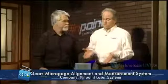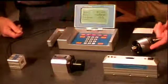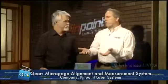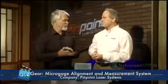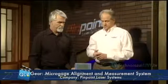Exactly. Okay. I mean, a typical example is in paper mills and applications like that. They'll set the laser up in the aisleway and they'll shoot the beam 80 or 100 feet down the aisle, and then they'll place this down at the distance to redirect the beam in to check rollers to see if those rollers are parallel. And that becomes important because if the material stretches over those rollers, it ultimately creates product that's not as useful as product that's lined up on straight rollers and is really flat and symmetric across its surface. It's really important to get rollers, particularly on web processes, aligned just right on the money. They do. They really do.